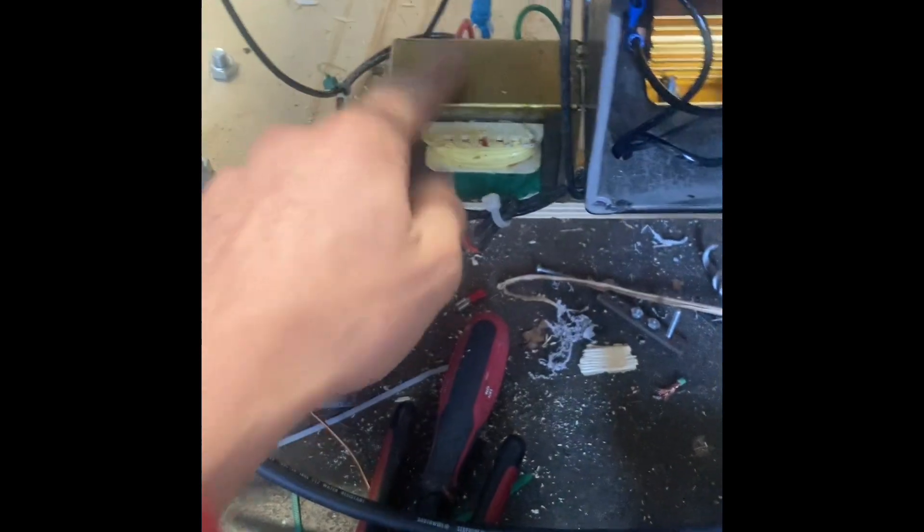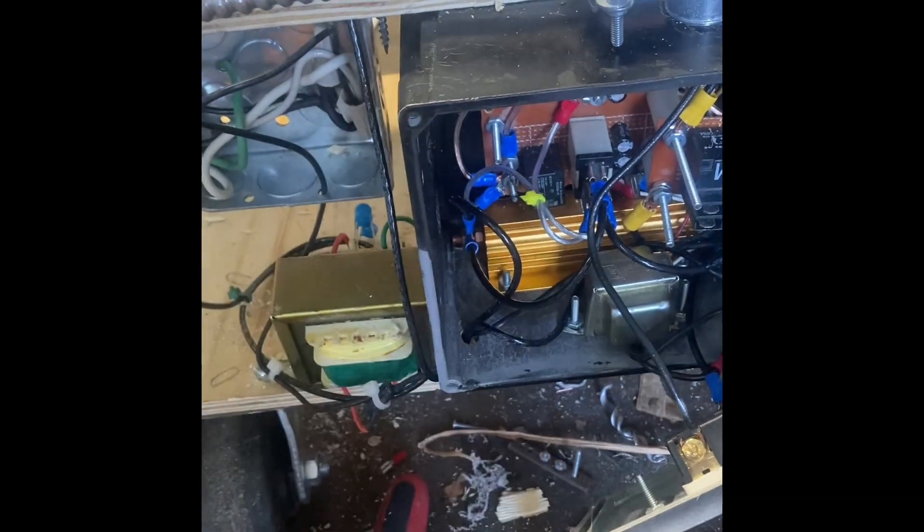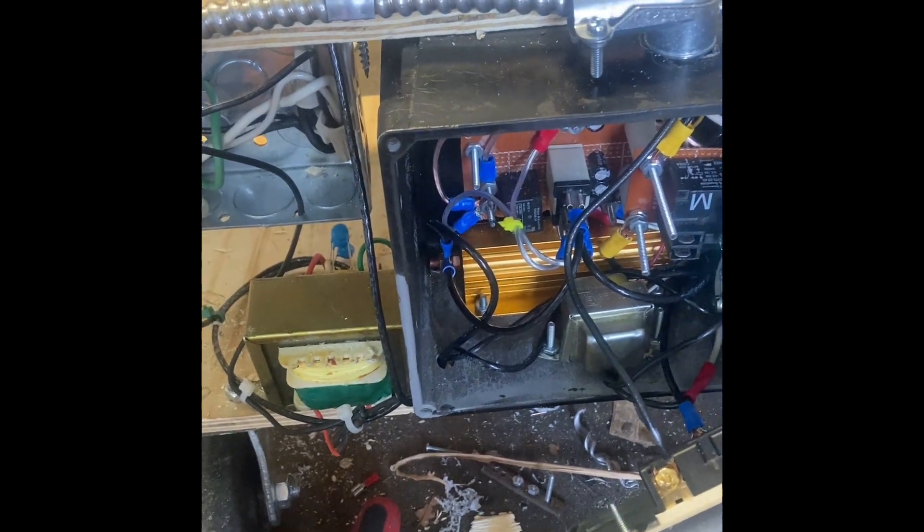It comes out of here and goes to these two transformers. This one will power the control circuitry, and then this one goes straight to the tube through the resistor. After seven seconds — however long you program with the potentiometer — it'll short the resistor, giving full power to the tube. Safety first; you never know when what you make will turn into a bomb.